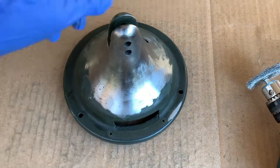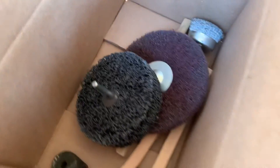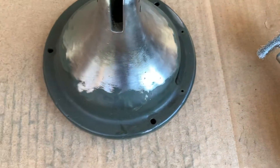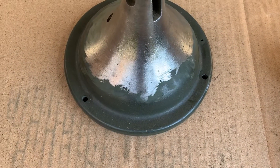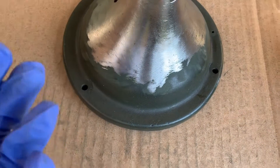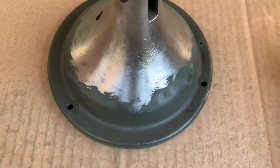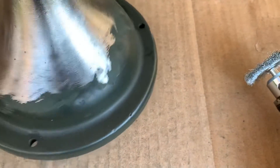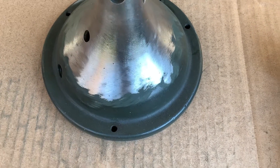I've been working away at this for about 15-20 minutes with the wire wheel — slow but steady, making some progress. I tried using the strip disc but it was a bit too aggressive and bouncy, just wouldn't stay on the metal very well. This wire wheel contours to the metal much better, so that's what I've been using. I was thinking about chemical strippers, but because of the liquid or gel and all the chemicals, I'd have to deal with flash rust, and I didn't want that. So just going the old classic wire wheel — about 50% done.